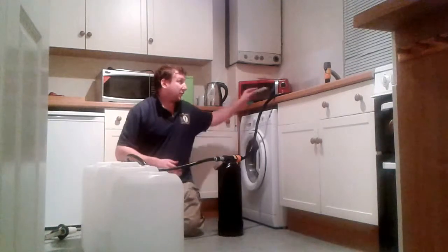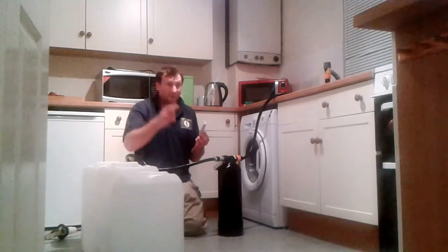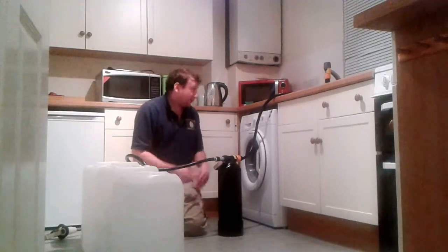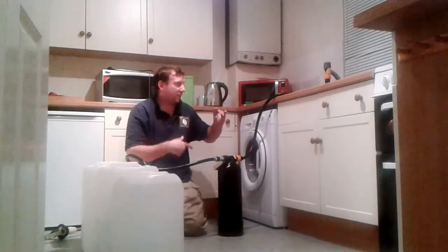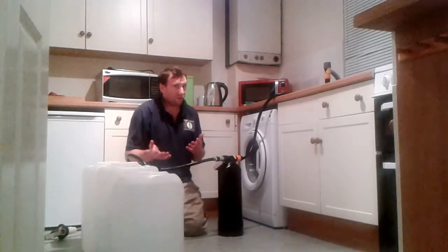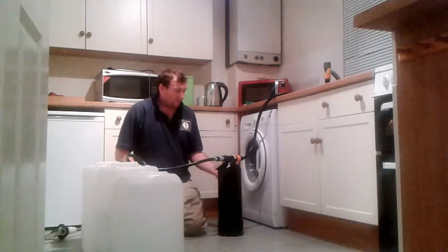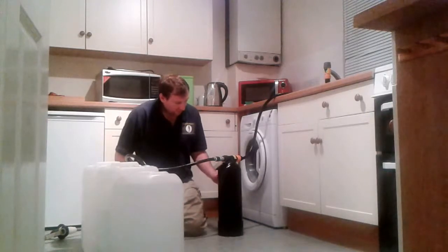The only other thing that I can say, well you obviously can get it to 0. I have done that a bit before. The resin obviously needs to be replaced, which is in here, the sand-like substance. So you need to monitor this. When it starts to get a bit higher, then you need to think about replacing it. You just need to use your own experience, skill and judgment basically for that. But it's a simple case of you just ring up your supplier, order it, my supplier will do it next day I think.